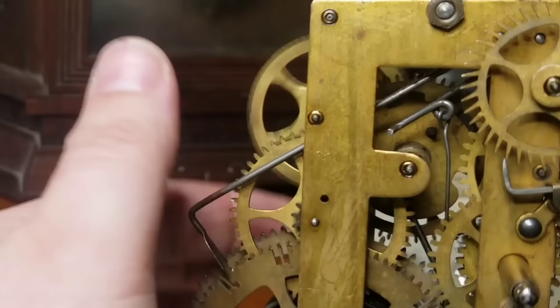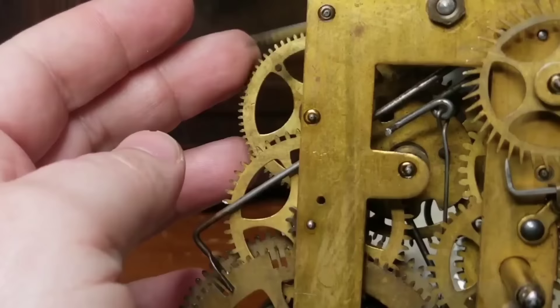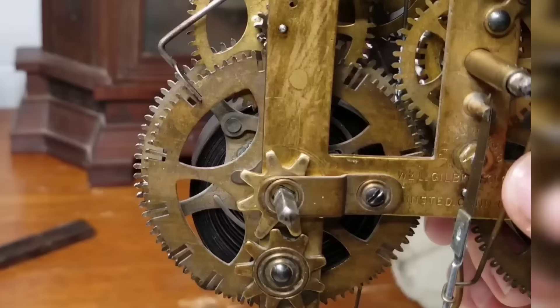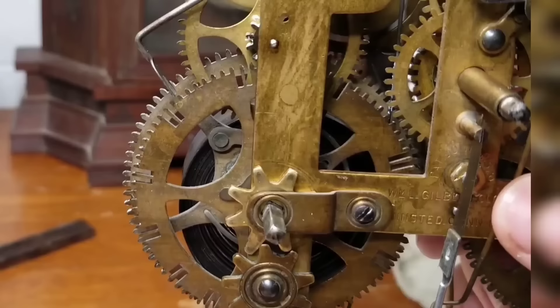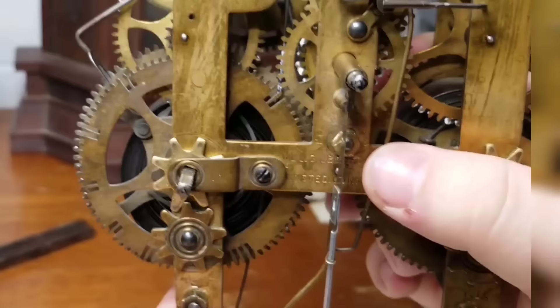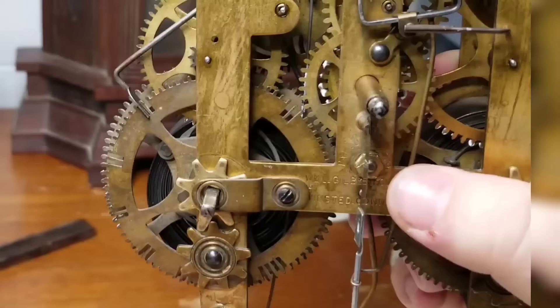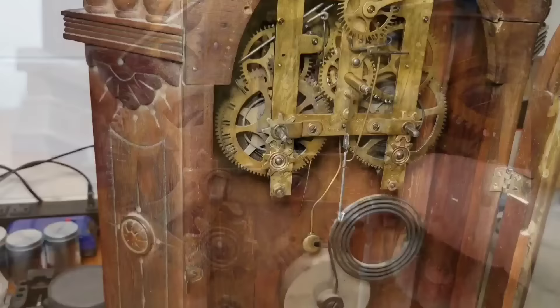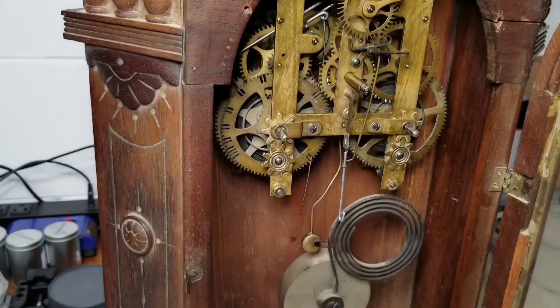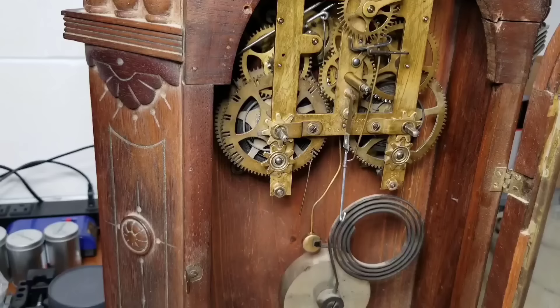While I was trying to figure this all out, I also noticed there's a bent tooth on the count wheel, so I very gently straightened that up. But I found that the main problem was the warning pin was missing the locking lever, so I had to take the movement back apart and adjust the warning wheel by turning it about 25% and then putting the movement back together. Once I fixed that, everything started working the way it should. The teeth in between the deep notches chime the number of times for the hour, and the second deep notch chimes on the 30-minute mark. Here I'm lifting the count lever with my finger just to test things out, but in normal operation the center shaft cam — which controls the minute and second hands — will lift the lifting lever, which then lifts the count lever out of one of those deep notches.